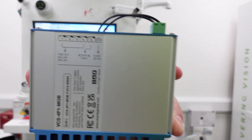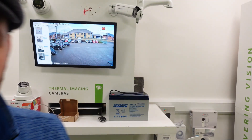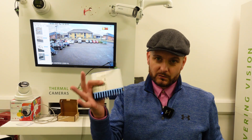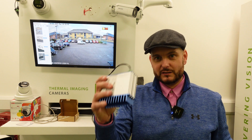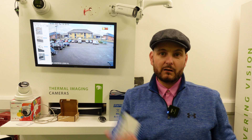This operates over a wide voltage range — down to 8 volts, up to 40 volts DC. So a wide voltage application. If you're installing in a vehicle, like a van or a car — which we do lots of — some NVRs have built-in POE, some don't. This gives you complete flexibility and versatility on powering your cameras, especially if they're not like-for-like.